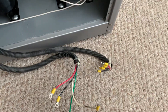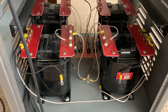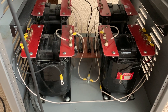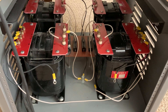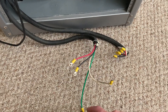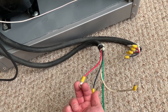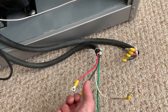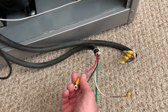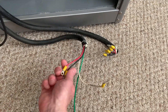What I didn't count on is I used solid-state relays behind this front panel years ago because I hate mechanical relays for plate switching — I don't like to hear the big snap and clunk. I like quiet electronic switching, so I used two big 40-amp relays. The way the two plate transformers were wired, it was just going across from this wire to this one at the primary on both of them. I had one relay in between one wire and one relay in between the other, so both were normally open.